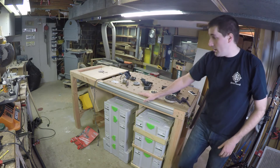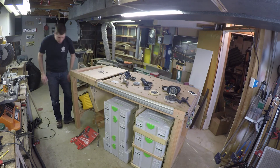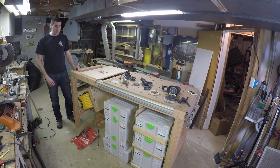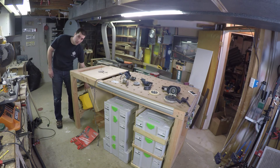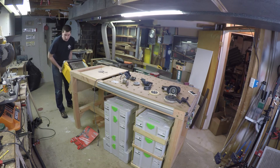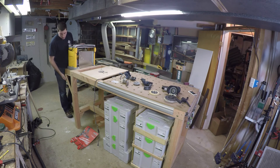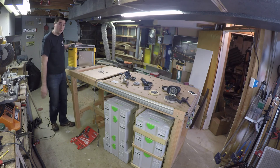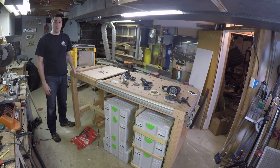The very last thing I have on here is my planer down here. The planer's always big and heavy and I always have a hard time finding a place to put it, so I built it into my table. I put it on some extremely heavy slides, and at the end you can just flip it up, put the braces on, and I'm ready to go. It's quick and easy, I always know where it is, and the mass of the planer adds to the mass of my table so it stays still when I'm going to be doing some hand work.